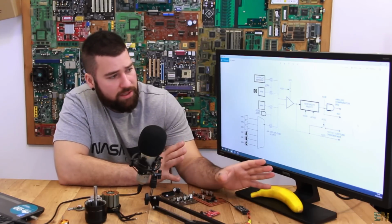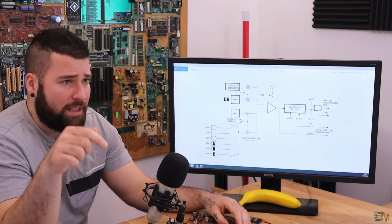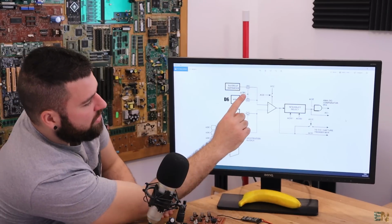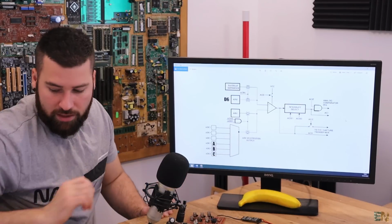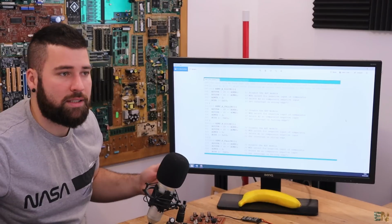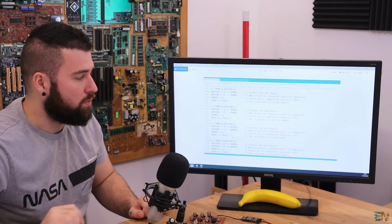I hope that you will understand this. This is taken from the datasheet of this microcontroller. You can download it from below if you want to take a look at it. All you have to do is to change these registers, the ACBG, the register for the ADC multiplexer, and here I have a small part of the code. I hope that you will be able to see this, and if not, I will try to put the entire photo for a few seconds on the screen.